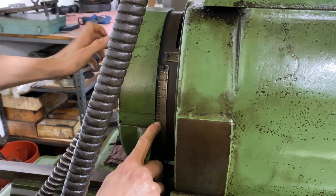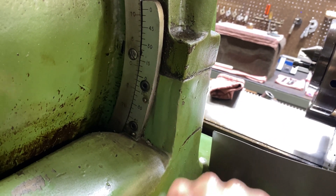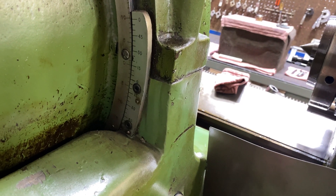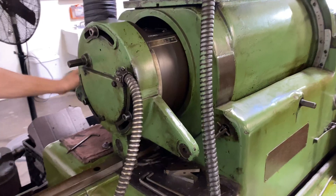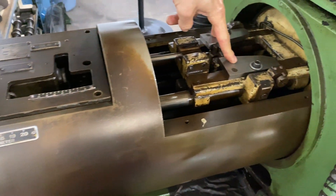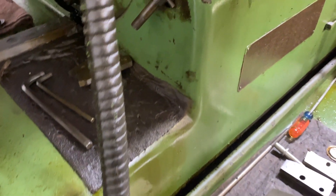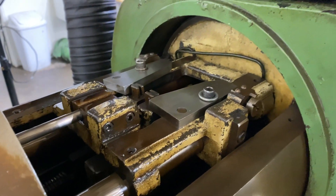We're just going through the motions of setting the whole machine up. It's degrees on the left and minutes on the right — a vernier scale, so where they're parallel you can grab a few extra minutes of precision. Very similar to our Fowler gear machines. This machine certainly doesn't disappoint in its complexity and quality of build. Luke's pointing out the two guide plates on the back that you set for the 20-degree pressure angle — it's also how the diamonds run on the blade to set the pressure angle on the side of the blade, which makes that same shape into your part.